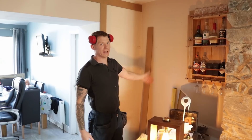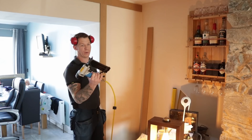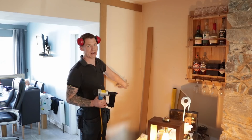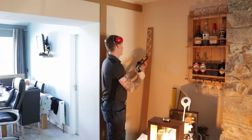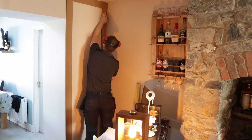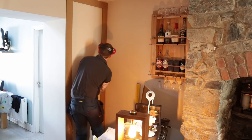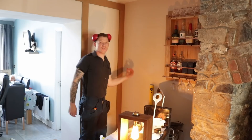Putting it up on the wall couldn't be easier. Just get yourself a good quality adhesive — the adhesive is going to do most of the work. Then I have some 18-gauge brad nails just to shoot into the wall to hold it. These are 20mm, so they go in about 8mm past the sheet. It's only to grab the wall while the adhesive does its job — stop the piece sliding. I can't go by the walls because none of my walls are level. That's not bad — just shoot a couple of nails in to hold it and it should be good.